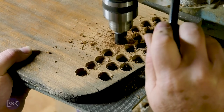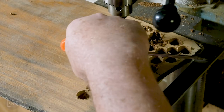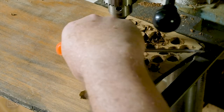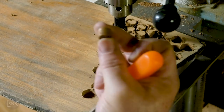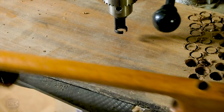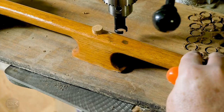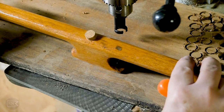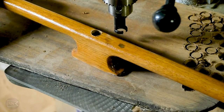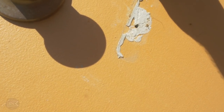These plug cutters simply drill down around an outside cutting ring, leaving an interior plug that can be separated from the wood with just a little bit of force from a screwdriver. This is an essential tool to have when you're working on boats. These plugs fit perfectly into the hole I just cut into the handrails. Next it was time to clean up the deck by removing the butyl tape and drilling the deck holes a little larger for the bedding and filling compound.